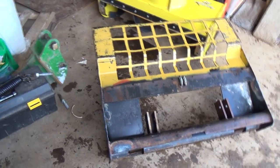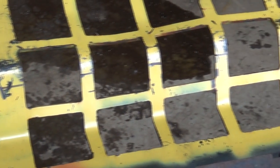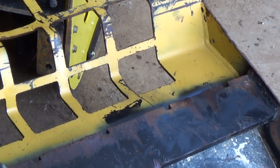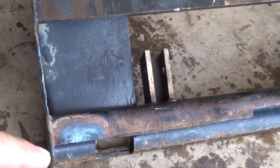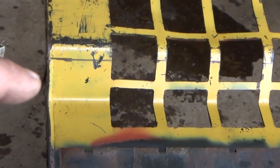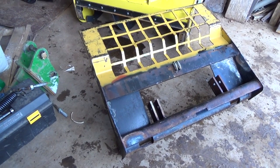Oh, anyways, just before I left today, I thought maybe I'd give this little mark where I'm gonna chop her. Maybe I'm gonna chop her there all the way across. Chop the top water off because I don't really need that, and that should make her from down here roughly the bottom of the bucket up to about here, and it seems to start to flare out there, so I'm going to cut her just at that flare right there. That'll make her 24-inch from there to the top. That's not too bad. That should hold a fair whack of dirt.